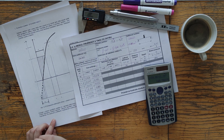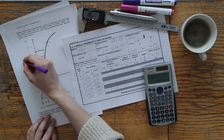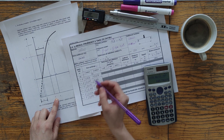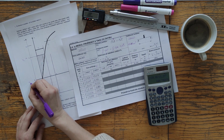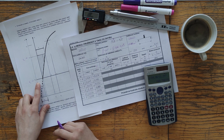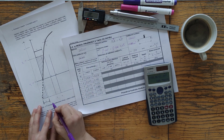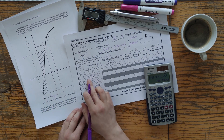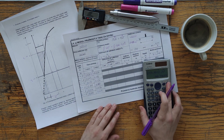Since we were loading and measuring, the principle of the measurement — looking at this graph — was that we loaded to force F1, which induced some stress, which in turn induced strain ε₁. After unloading to the zero force, which induced approximately zero stress, we obtained the so-called zero strain. What we need is this value, which we can denote as ε̄ᵢ (epsilon i with a bar). We obtain it by subtracting these two values from each other, since we have one value and the second value.